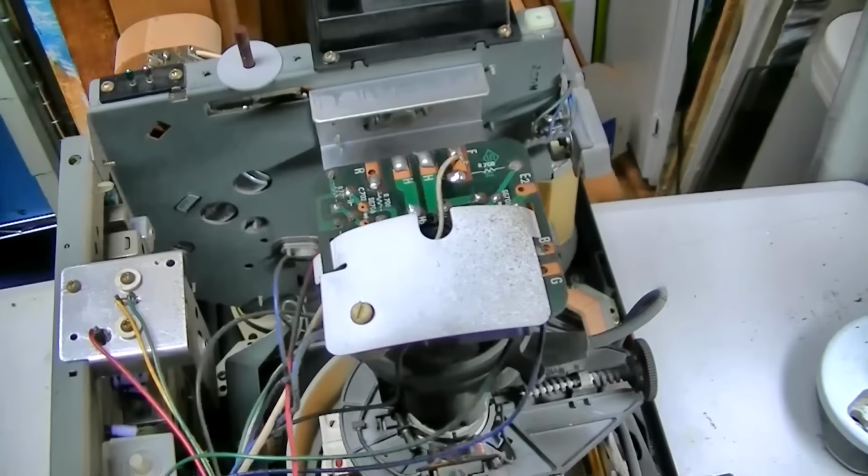I have acquired electrolytic capacitors, and I'm going to show you how I change just one, and you don't need anything fancy, soldering station and $50 roll of solder braid and all of that. All you need is just a 35 to 50 watt iron and a little bit of patience. And I'll try and hold this thing in my mouth because I can't get a tripod in here. And I'll show you how I change this.